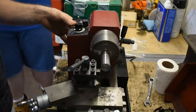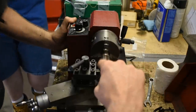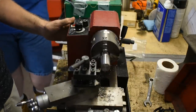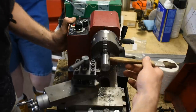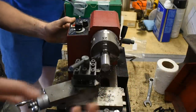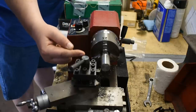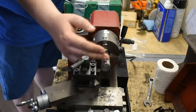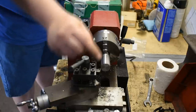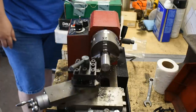Let's turn that off and see what we ended up with. We can still see it's a little offset — the tool is actually riding right over the top and not touching part of it. We're getting lots of spirals, and that's okay because we're rough cutting right now, just trying to get it close to shape. The workpiece is unsupported, so as the tool pushes it, it deflects a little. On the back side the tool is scraping, which creates the spiral. We don't want to reposition because we're at a specific depth — it's fine, we're not at the finishing pass yet.